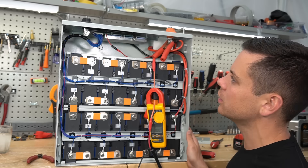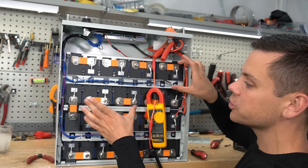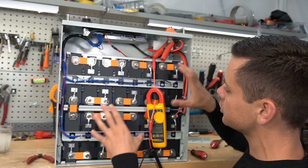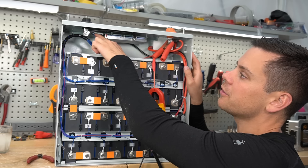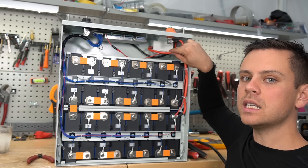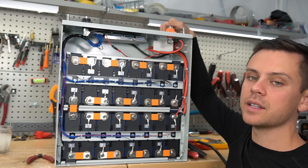Because this is the same BMS as the 12-volt batteries, these have an extremely low failure rate - I think out of like 10,000, they had two or three that had problems. So these are pretty reliable. The connections are good and every screw I've taken apart has been super tight. Something that people like about SOK batteries is that they're serviceable. The 12-volt ones, the server rack ones - all of these bus bars you can remove from the cells and pull the whole thing out in about 20 minutes. All you need is a screwdriver. And if there's BMS failure, you could swap it out in a few minutes.